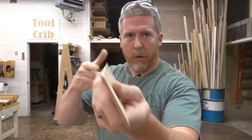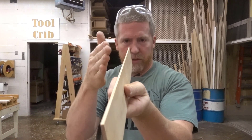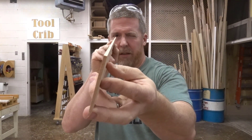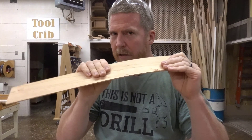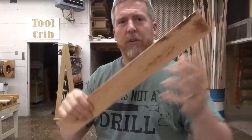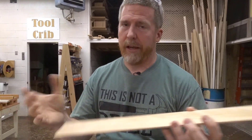Right now, take a quick glance — aim straight down and look at the edges. They should be a uniform thickness. If you see a lot of variability because you weren't quite tight on the fence, this is when you can cut another one. That board I gave you will probably give you four cuts — three at least. They look pretty uniform. I would even bend them a little — if you hear any cracking at all, you'll definitely hear cracking when we try to mold them around our molds. So now's the time to make sure. If cracks exist, may as well get some new ones now.